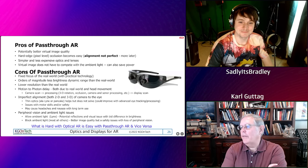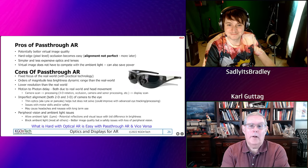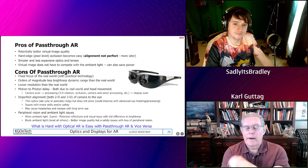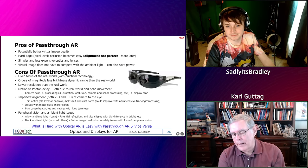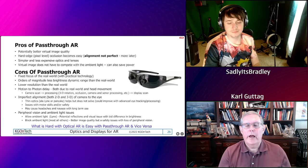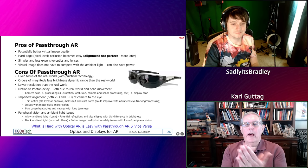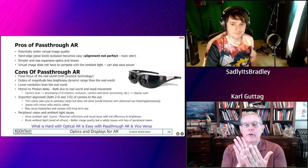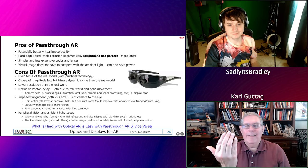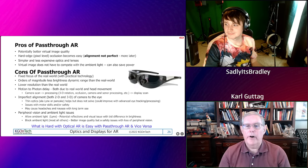Pass-through AR is somewhat a fancy way of saying that if a camera's in front of your VR headset — and it sounds so simple. One of the big problems in AR is what we call occlusion. We basically take the light from the world and the light from the image and combine those two sets of light, so you always get an additive result. If your background is bright white and you put up a yellow something on it, you're not even going to see it — it'll be a ghostly, very faded, very faint image.